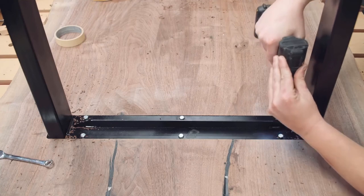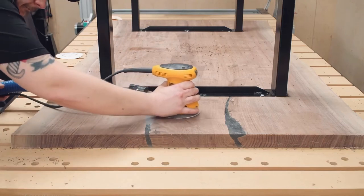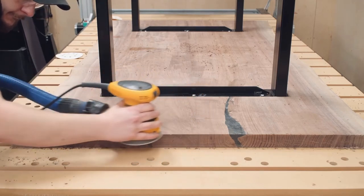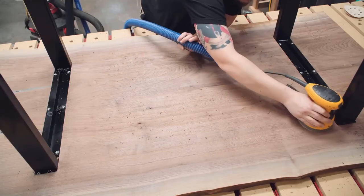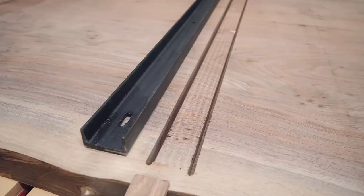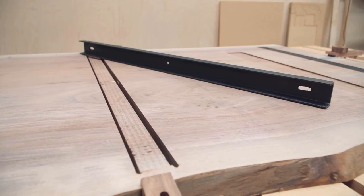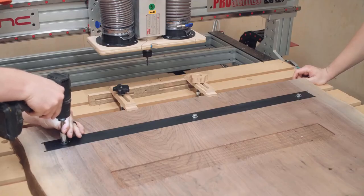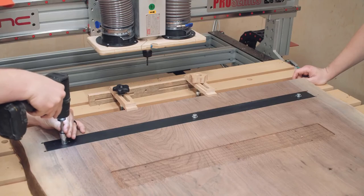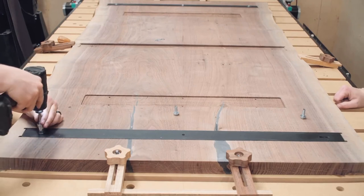While we have this set up on the CNC machine with the bottom side facing up, it's just a big work surface, so it makes sense to leave it here to do all the sanding on the bottom side, make sure the legs are attached, and all that before we flip it over. Once we flip it over we can address the live edges, clean those up, and then sand the top - there's going to be a lot of sanding, this is a lot of surface area. Just that fast we got ahead of ourselves with the order of operations - we should have added the C-channel pockets and the C-channel before sanding. The whole point of this C-channel is to keep the wood flat over time. It's regular 3/16th-inch thick C-channel, two inches wide, one inch deep, and in our case 34 inches long - milled just like the table legs with holes in the middle and slots on either end.